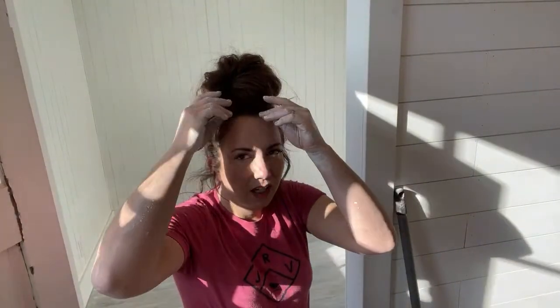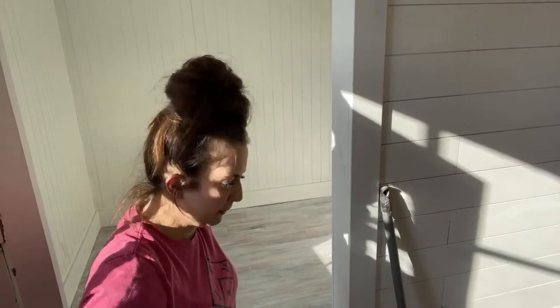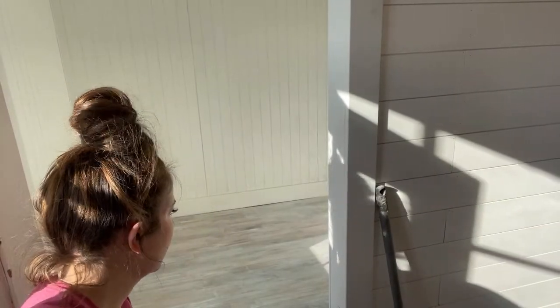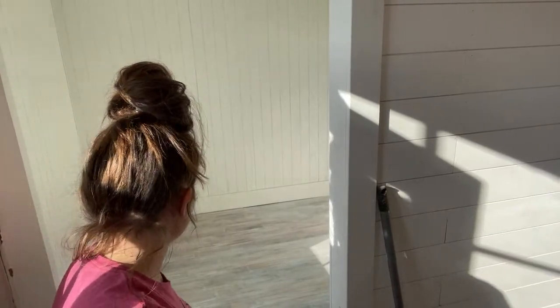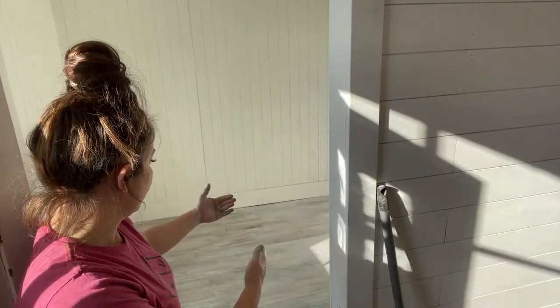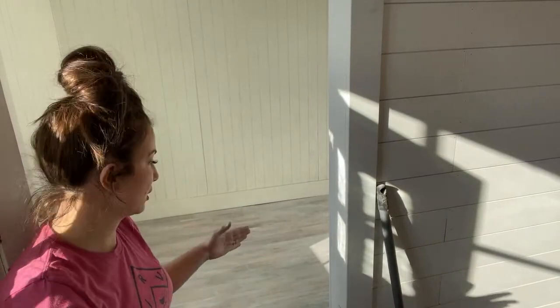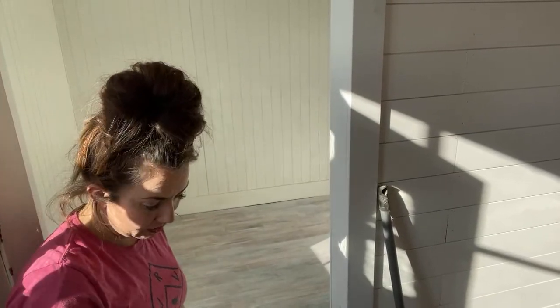You can buy a pint — a pint would do about 90 square feet. I would get two pints for a floor this size. If you do the whitewash first, the floor is only going to absorb what it can, so the oil wax goes further.